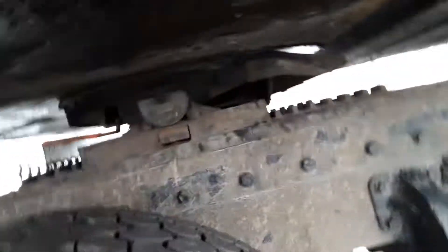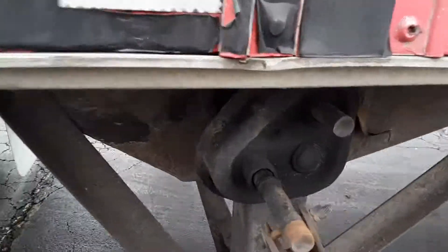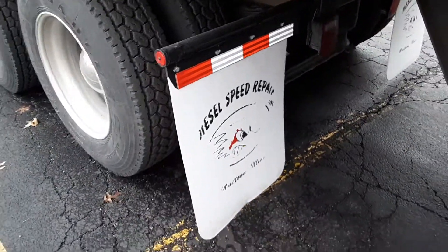That's your tires and rims, spring hangers, bellows. That's your fifth wheel — this is the thing that unlocks it, this is the thing that slides it back and forth. Your landing gear — this is how you crank it. That's your mud flap; you're always checking there — cannot be more than one rivet missing out of a group of four.